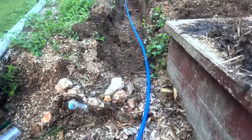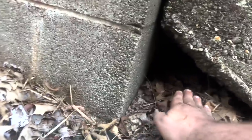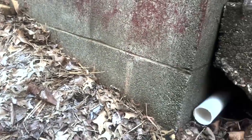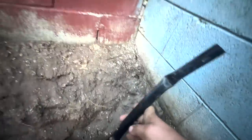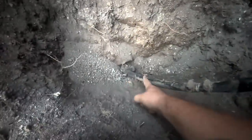I'm going to rip all this out and redo all this, but not tonight. We'll bring the water line in here and through there with that piece of pipe to protect it, then fill dirt all the way down here and up these steps. We'll pull this out — this is all junk and we're going to cut this off right here. Our new line will come under these stairs right into the house.